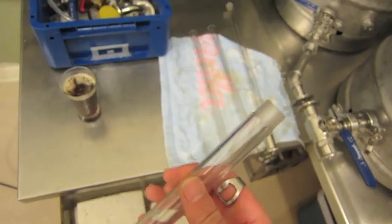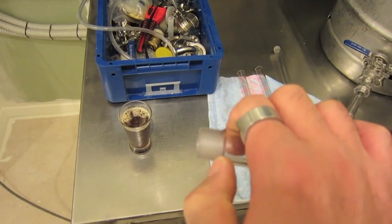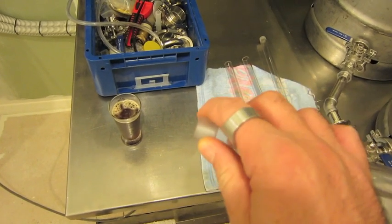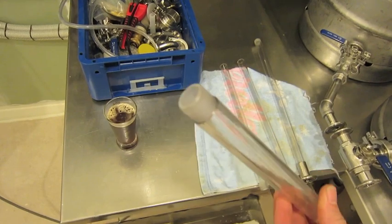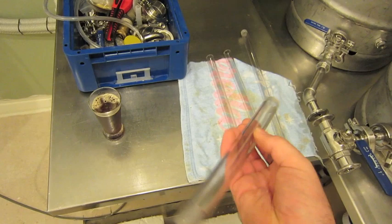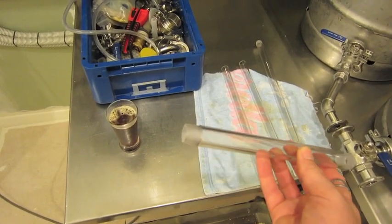I've got my pipe down here. I ended up going and getting the edge of the pipe turned down on the lathe — down to 21mm — so that I could tap it, because the pipe was a bit thicker than what the tap wanted. I got my lengths cut and took it to Banksy and got him to turn it down at both ends.